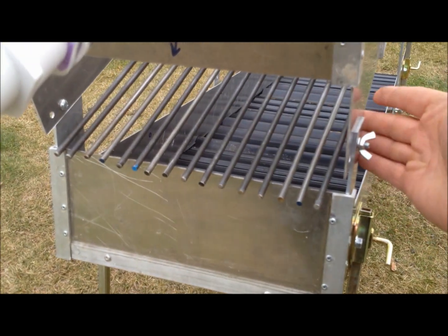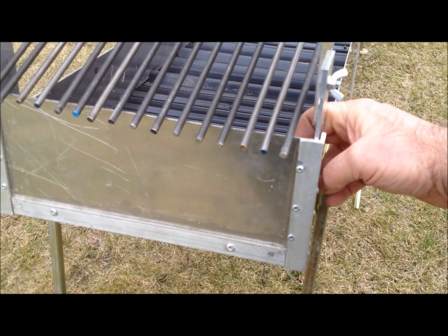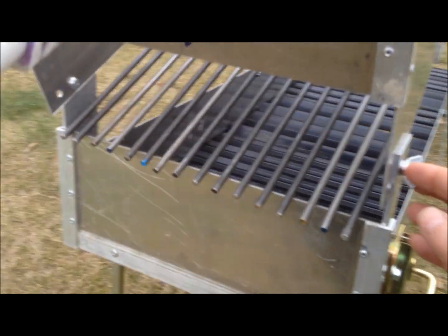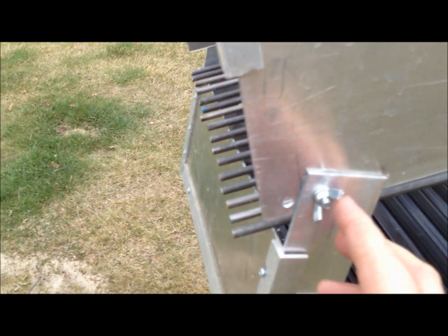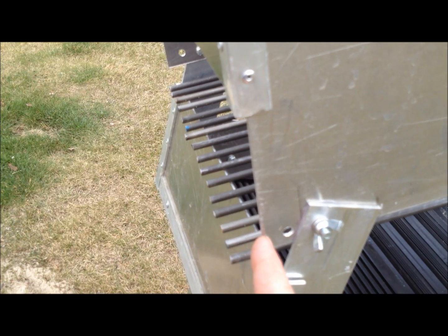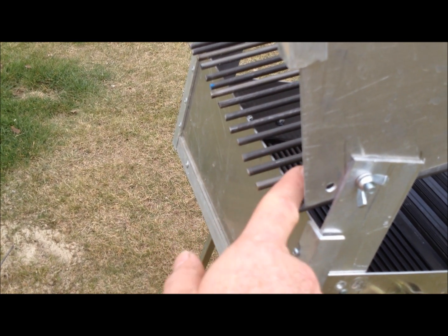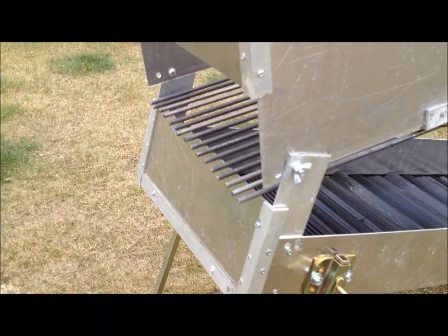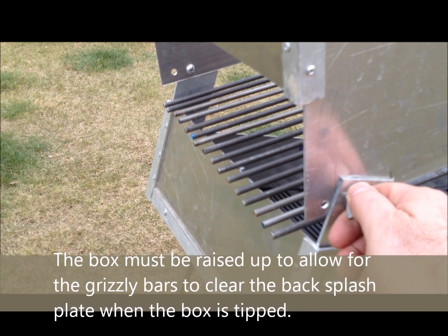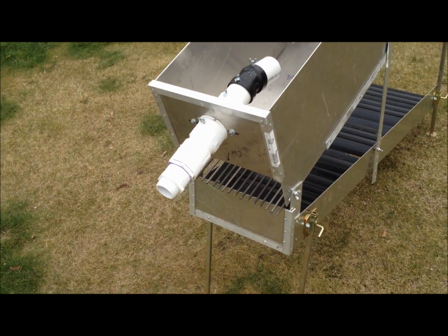In order to lift my box up, I took a two-inch piece of flat aluminum on both sides and raised it about an inch and a half above the back. I offset the screw toward the back end of the hopper so that it would have an overhang — you've got to make sure that your Grizzly comes over the top so that rocks aren't getting caught up and causing issues. The reason you build it that way is so that it's hands-free and the rocks slide off. I built this up two inches above the back end, offset it, and put a couple of holes in it if I want to move it back and forth.